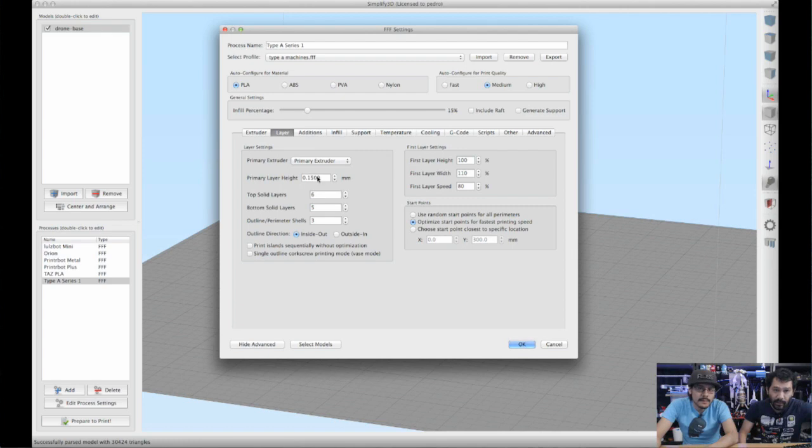So the default that we have our layer height set to is 150 microns, and that works excellent, especially when you have organic shapes that are sort of going off like that. You don't see like this giant separation between the layers. It nicely fills the gap in between for all those. Yeah, very cool. Well, so the top layer, bottom layer, you were printing some copper fill and Ninja Flex, so that's why these are bumped up so high.